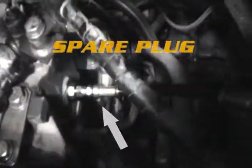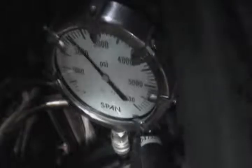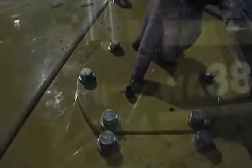For the hydraulic pressure, there is a spare plug on the pump. Remove the plug and insert a pressure test gauge to ensure proper pressure. Once the pressure point is determined, insert the appropriate steel adapter. For the return port, there is a spare plug on top of the oil reservoir. Remove and insert the steel adapter.